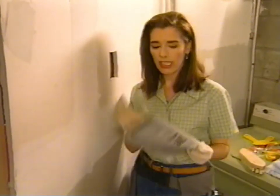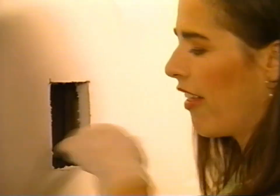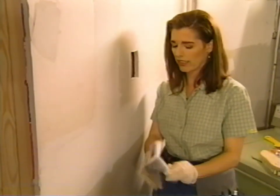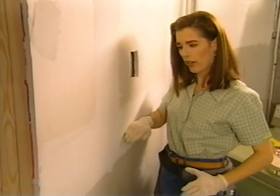We've got the hole, and we get some newspaper and start by stuffing the hole. You might think I'd be standing here stuffing paper for days, but in fact there's a piece of blocking in the wall right about here, so the paper doesn't go down very far.